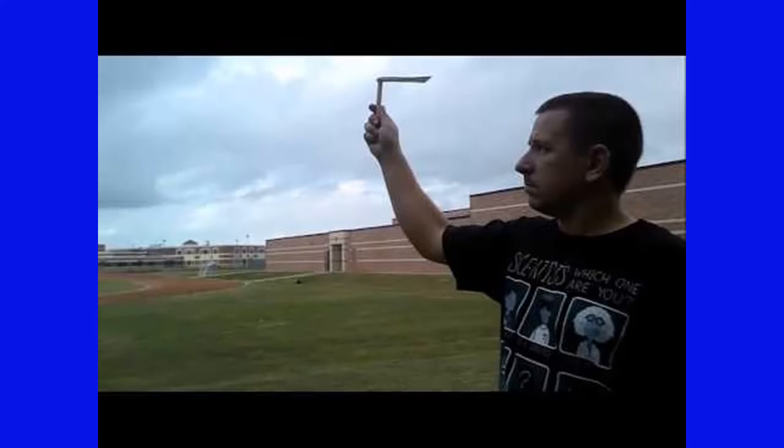This may mean suspending the pour until such time as the evaporation rate is reduced or providing other cautionary measures to reduce the effects of evaporation. For instance, to help with the effects of lower humidity, a fogging device is used. Or windbreaks may be set up to help reduce the effects of the wind at the site. With smartphones now, atmospheric conditions can be pretty well estimated in order to help determine the approximate evaporation rate. Some of the old timers out there may remember calculating the relative humidity with the use of a sling psychrometer.